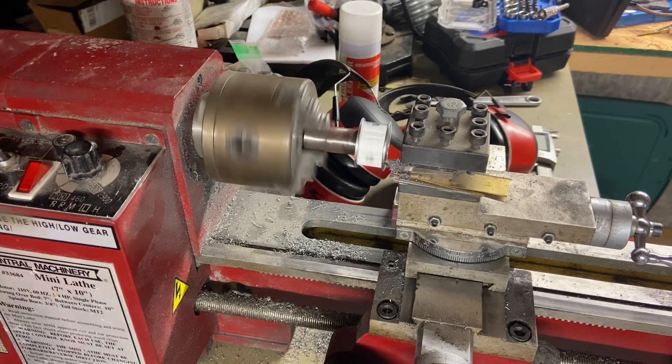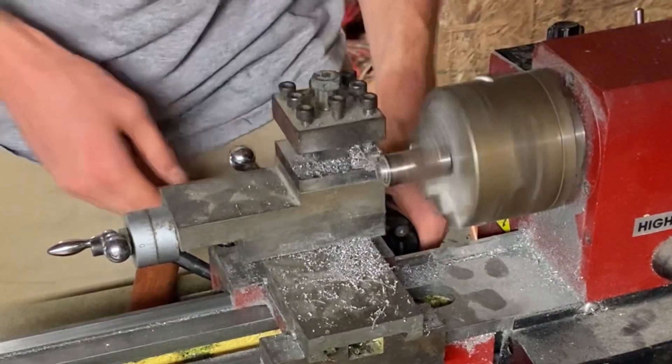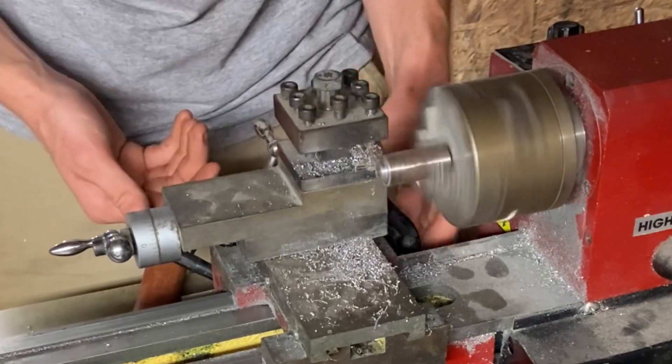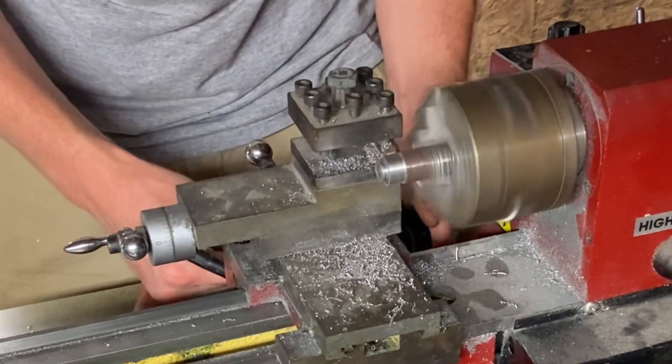The jaws aren't reversible as far as I can tell, so it just didn't go in. Also look at that amazing concentricity — that one's on me though, not really the lathe's fault. I just didn't glue it on quite right. I'm going to cut the steel back a little bit further so that more of the steel goes through the bore of the pulley and I can avoid this issue coming up again.